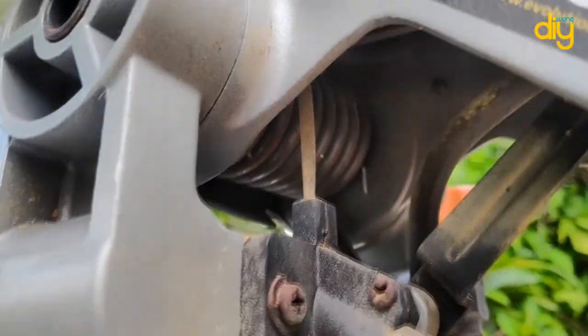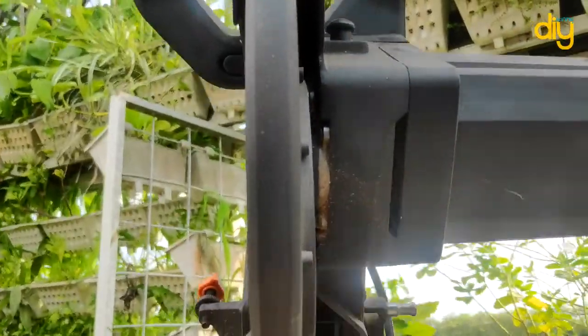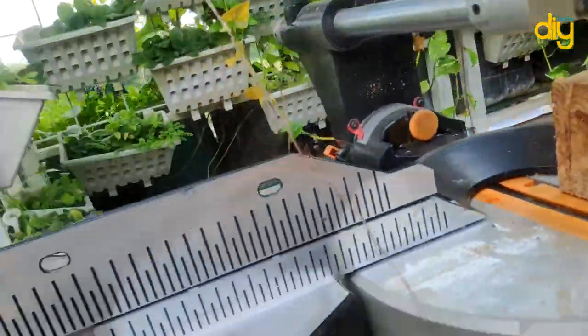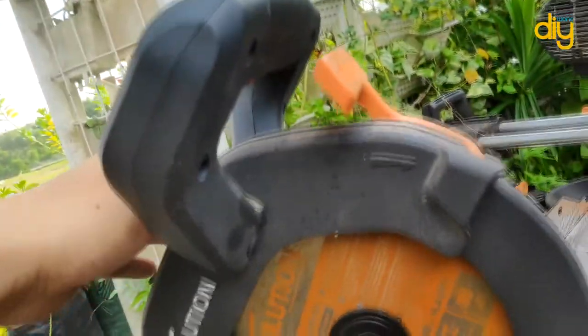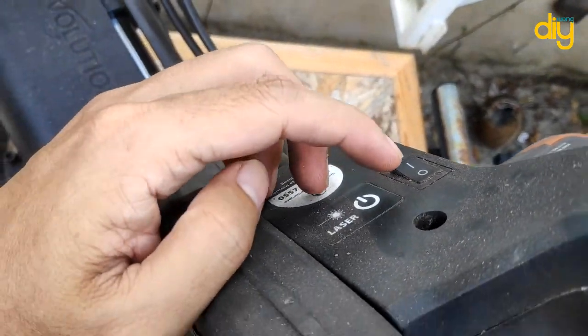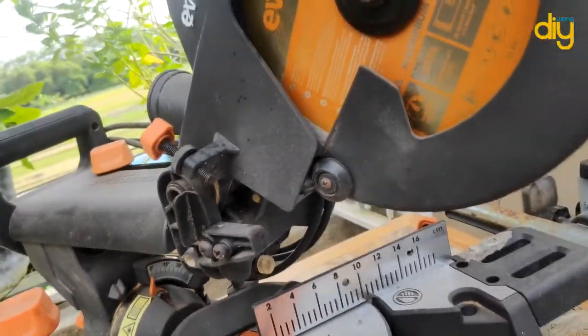The spring mechanism for cutting uses a horizontal spring coil placed underneath, and this applies to both of these miter saws. Another feature they share is a laser cutting guide, which is a nice touch that you won't find on other budget models. This helps get your cut with absolute accuracy. If the light is dim or there's a lot of sawdust around, it allows you to easily follow the cutting line — though you have to make sure the laser is aligned perfectly to your material.